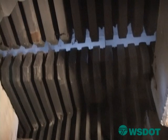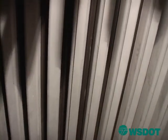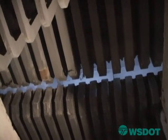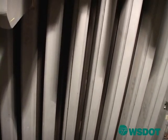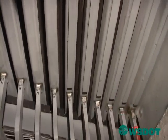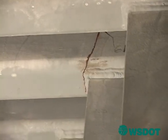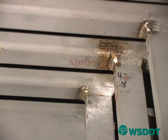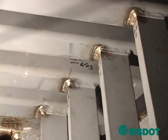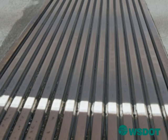Now that we're under the bridge, you can see the cracked expansion joints. These joints let the bridge bend and move with the wind, waves, and traffic. There are four of them in these bridges — two in the express lanes and two on the main line. The small ones weigh 40 tons and the big ones weigh 65 tons. They're all cracking underneath. Here you can see where our crews have welded them back together year after year. If we let this cracking go, they could possibly pop up and your vehicle could slam into them at 50 miles an hour.